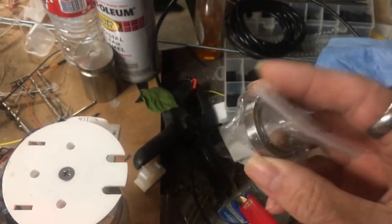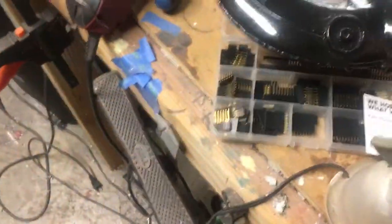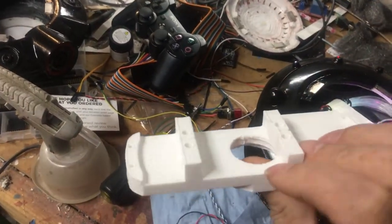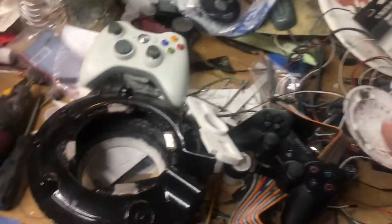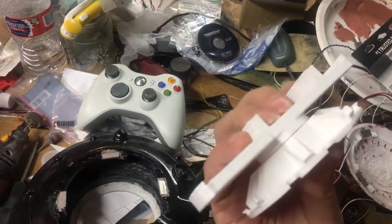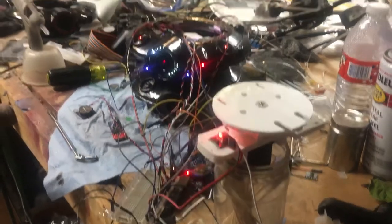The core body uses a bearing to disperse the load. This is the first one I ordered — it's bigger than it needs to be, really. That's a 25-millimeter inside diameter; I've ordered smaller ones. The bearing fits inside the body, the brace the servo attaches to, and then the spin plate bolts to a drive shaft that's attached to the servo to form the core body parts. It's very strong — I have no concerns about weight on that at all.